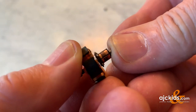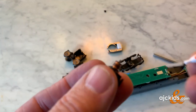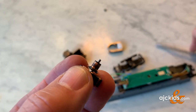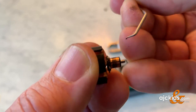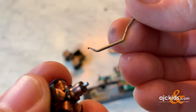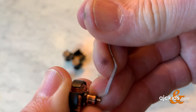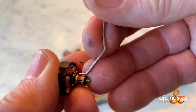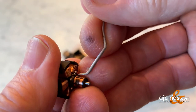This is a different armature that I have. It still looks pretty good, but these grooves already require cleaning as well. You can do this with maybe a business card and try to slide that through the grooves, or I use a dental cleaning tool here and kind of wipe these grooves clean. And if there's a lot of residue buildup, then you can use a pointy tool like I do here — you can see how much is coming off on that first try. You have to go through all the grooves and clean out the junk that has built up in it. That's a mixture of carbon and oil; it becomes sticky and it actually conducts electricity, and that's what's causing your issues with the locomotive.